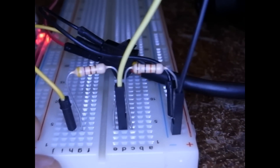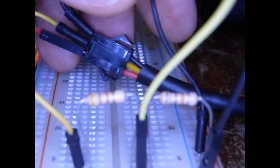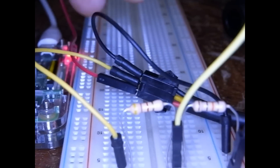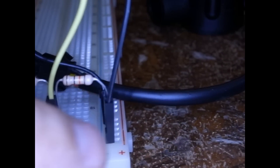That's pretty much it for our divider. Let's go look at our plug. Our sensor has black, yellow, and red wires, and I'm using the same color scheme. The red wire is the 5 volts from the Pi, the yellow wire is to the voltage divider, and the black wire is just over here to the ground.